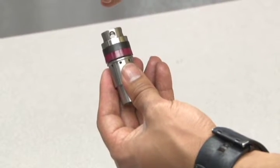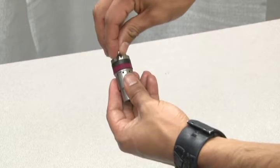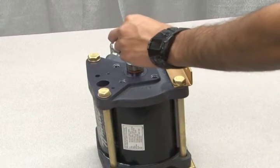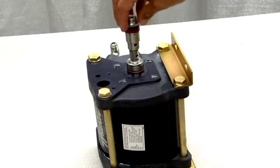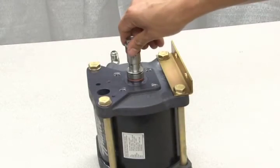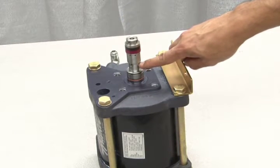Tighten the nut until the holes line up properly to insert the roll pin. Use a vise or soft mallet to push the roll pin into place, making sure not to damage any other parts. Now replace the inner spring, pin guide, and ball onto the piston shaft. Then screw on the piston head. Tighten until it bottoms out, then adjust the hole so that you can insert the other roll pin.